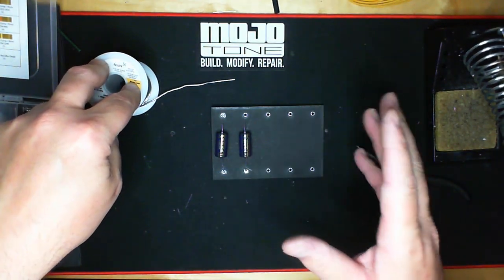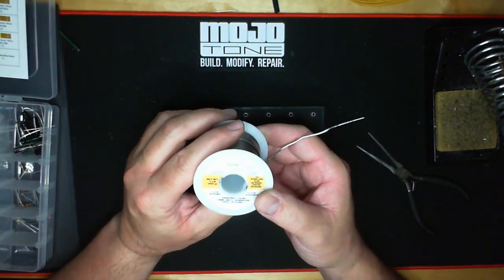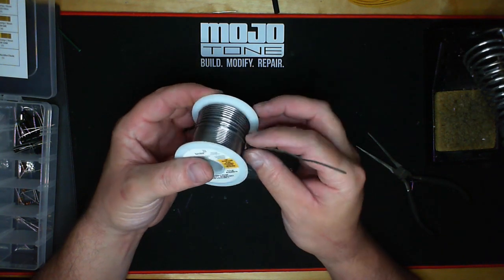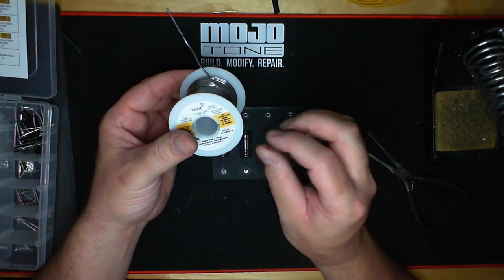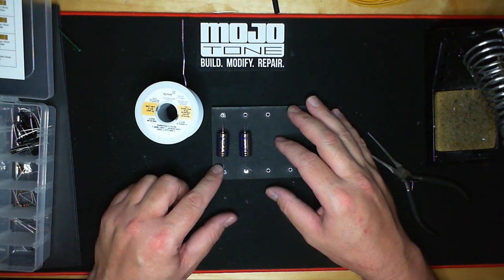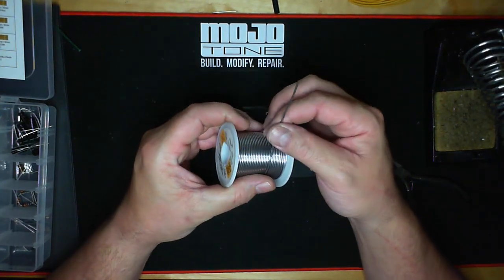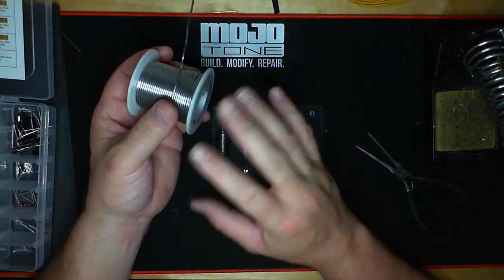One thing I will say: some people in the shop like to use rubber gloves when handling this. Any time you handle this solder, it's a good practice to wash your hands immediately after. The lead content is low — I can't remember the exact percentage — but it does have some. The component leads are typically copper or Inconel, pre-tinned with a lead-type tin. The ones that are RoHS compliant use some other type of coating. I highly recommend anyone handling this solder: wash your hands immediately before you do anything else — don't touch your face, don't eat a sandwich. Wash your hands really well and you'll be totally fine.